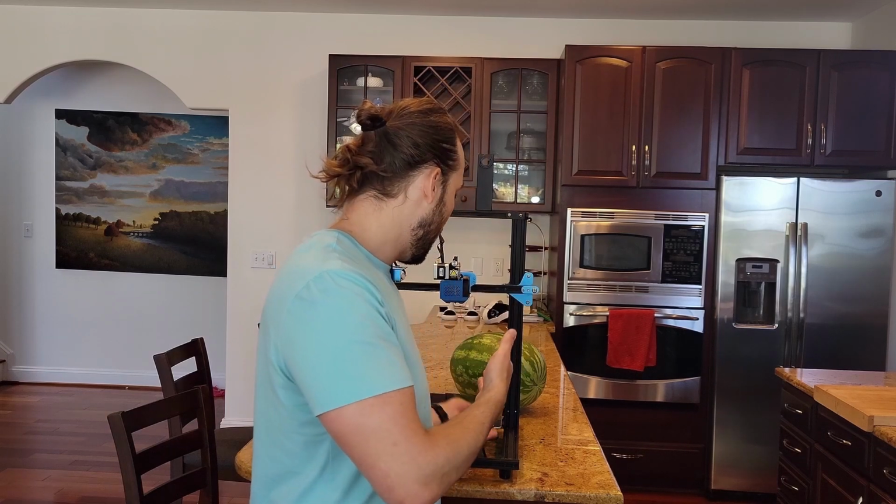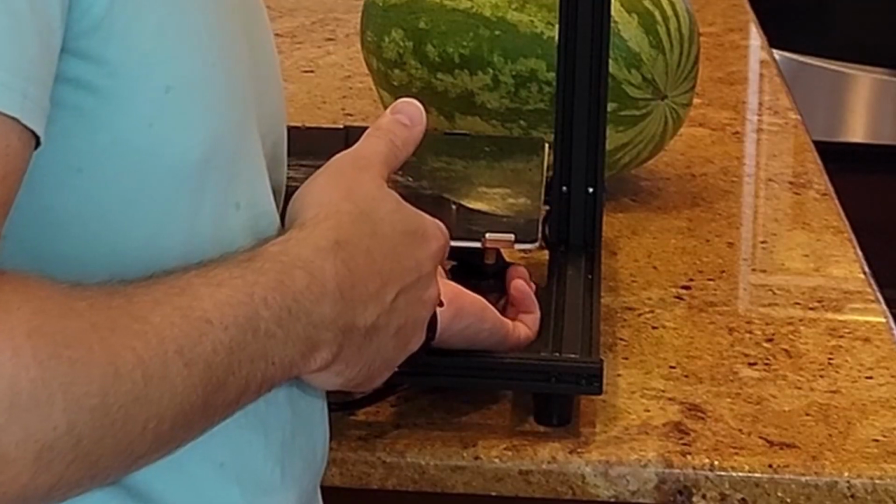This printer is infamous for getting out of alignment mid-print. And the only thing that you can do is try to self-adjust it by hand mid-print. And that gets really, really tricky. So mid-print, I would always find myself coming down and taking a look at the print and judging whether it was needing an adjustment or not. And I would have to come down on this corner only and readjust this wheel constantly. When I would do that, it would go back out of alignment. And the next print I had to do, I would re-level the bed.